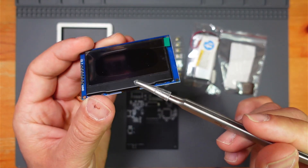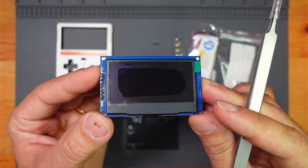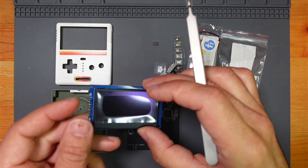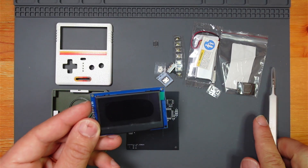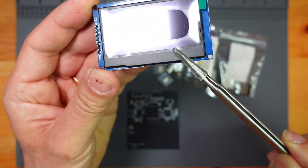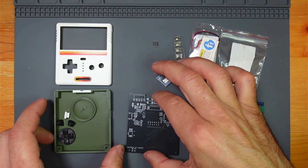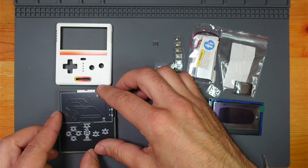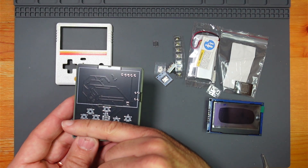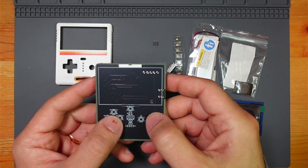This screen needs to be taken apart because it doesn't just go on the board as-is — I'm only using the raw screen out of the housing, which wouldn't fit in the case. Every project I've seen using a 'big screen' RGBoy build has just slapped the whole module on the PCB or wired it in, but that wouldn't fit in the case. Plus I didn't want this ugly surround. So this gives me one of the smallest form factors with a large 2.42 inch OLED screen.